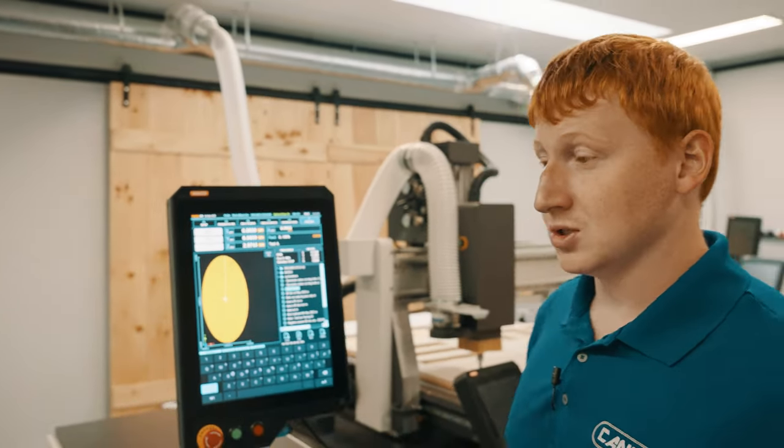It is extremely important to press the spindle CW button to prompt your spindle to turn on before you continue the program. To start your program, you can hit the rewind button once, followed by the green cycle start button. This will allow your program to begin. Alternatively, you can press and hold the green button on your controller to perform cycle start, or the red button to perform feed hold.